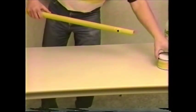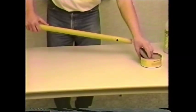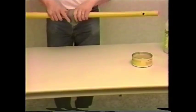Hastings Fiber Glass Products recommends an application of fiberglass wax on the hot stick surface after cleaning and drying. Use only wax recommended by the manufacturer. It is important to retain a glossy surface as a moisture barrier and to allow the water to bead up on the surface to pass the wet test.